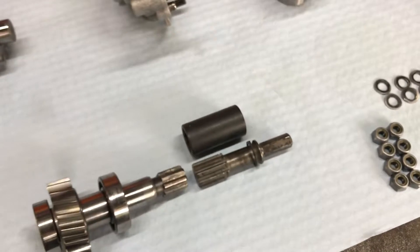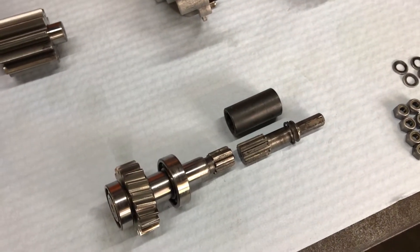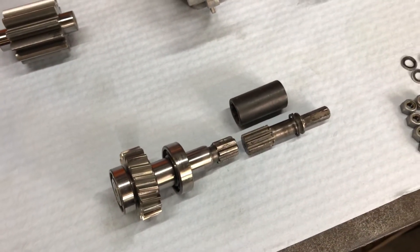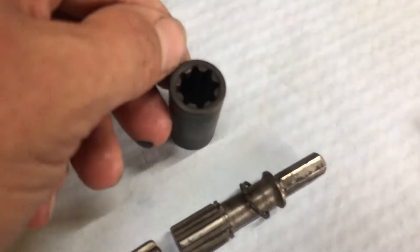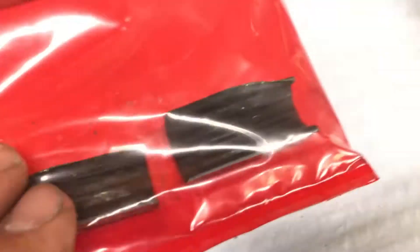This sleeve is the very first thing that's got to come off when you disassemble the oil pump. If you try and pull that off, hit it, whatever you do, be very careful - because if you're not using the right technique, you're going to damage the pump. What we generally do is carefully grind along the length of the sleeve, all the way down almost through the root of the tooth there. Here's Sean's that we've cut off. We've just ground through until it's just wafer thin - we haven't actually touched the shaft. Then we've broken it through and opened it like a clamshell and pulled both halves of the sleeve off.